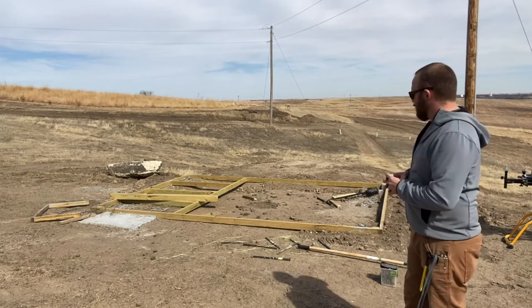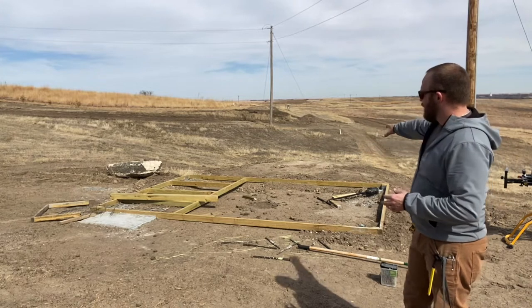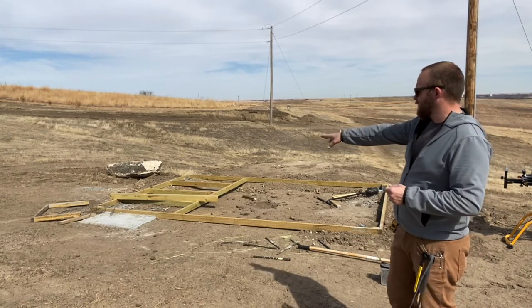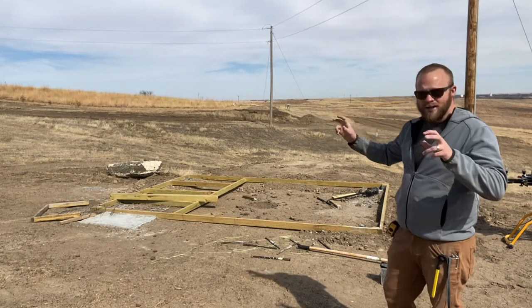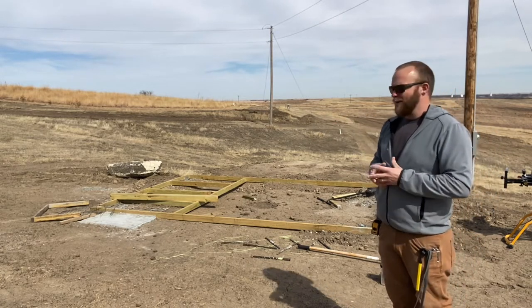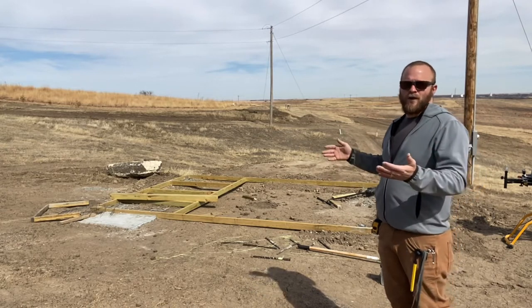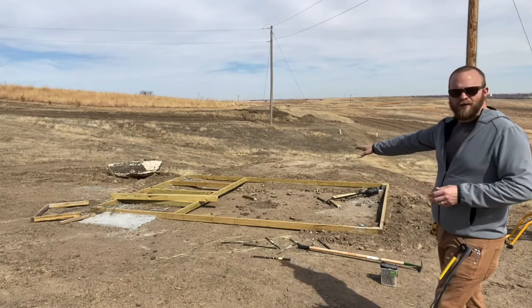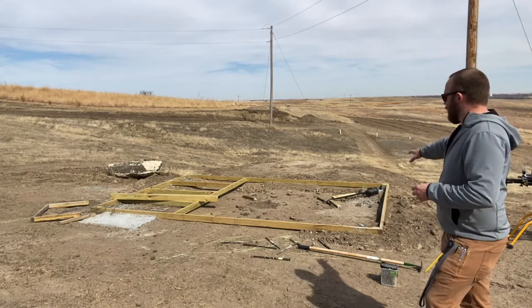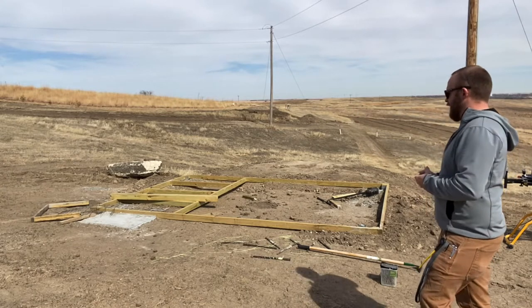What I've got here is a 10x15 frame. The open run area is 10x10 with a storage area that is 10x5. The 10x5 area is going to be traditional stick framing, probably 16 or maybe even 24 inch on centers, just because I want to put a window on the west side. And then this will be a pole barn style framing over here, and they'll all tie together appropriately — it'll look nice in the end.